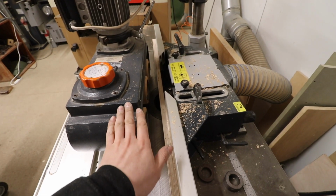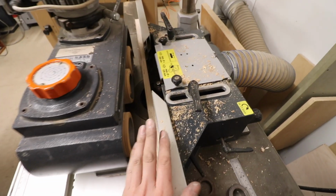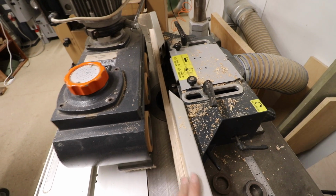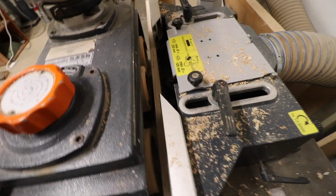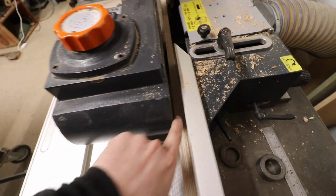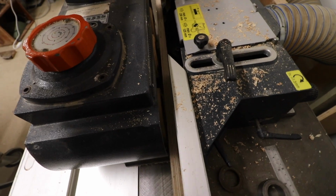So it's effectively trying to push that material in this direction across the fence, and because the fence is there, it runs nice and tightly in a straight line along the fence. So when we're running it backwards, obviously we've got to adjust that so that the back wheel has the most gap, and the wheel here, which effectively will be the back wheel, is closer to the fence.